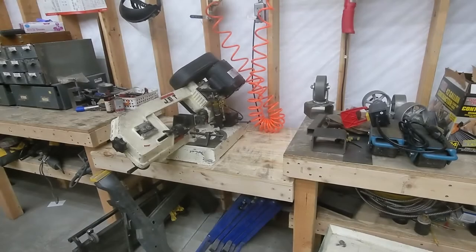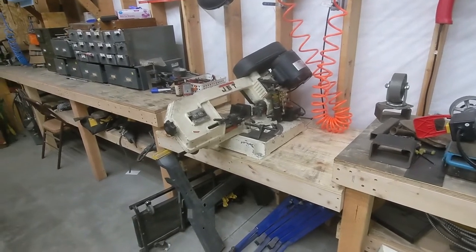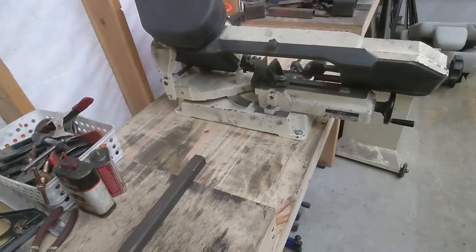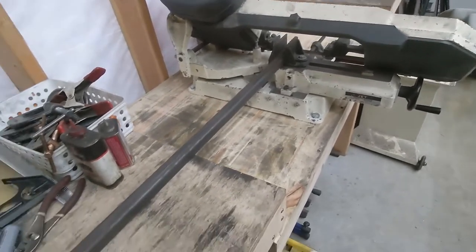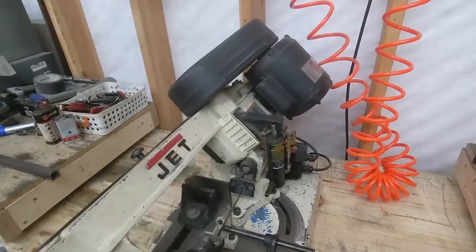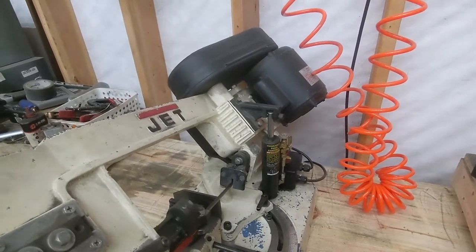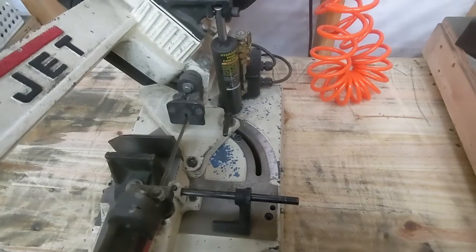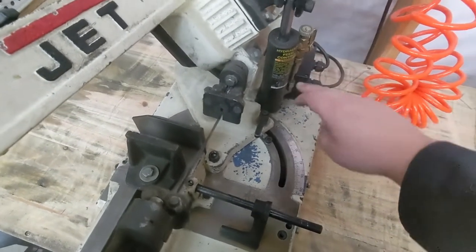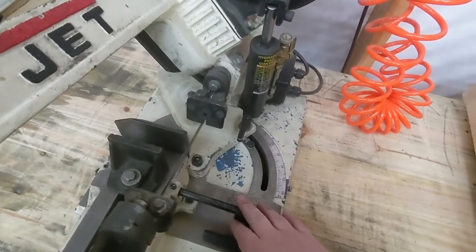The last big thing I wanted to do was rebuild my horizontal bandsaw nook. I use this tool all the time — basically every project starts here. It's lowered to put its vise at the level of the surrounding benches, meaning I never have to set up inflow and outflow stands. Overall I'm quite happy with the setup, except for a few problems: it can't open fully in every position due to this wall stud behind it, something I didn't notice until after the original construction was done. And I have to reach quite a ways over it to get to the power switch. It's not a particularly scary tool, but I'd still rather not risk some part of my body or clothing getting caught up in it, and I'd also like an easier, more panic-proof way to shut it off — just in case.